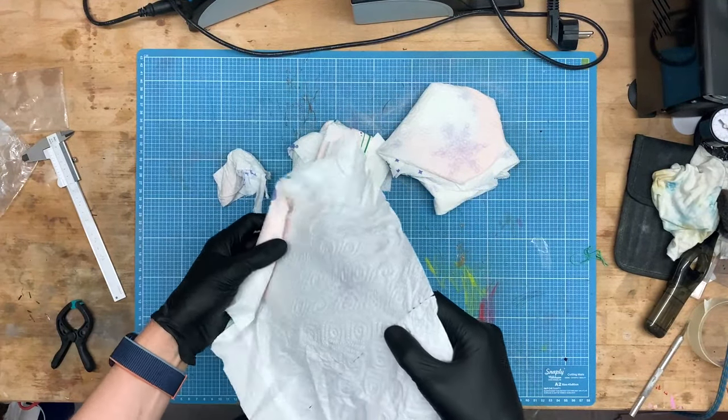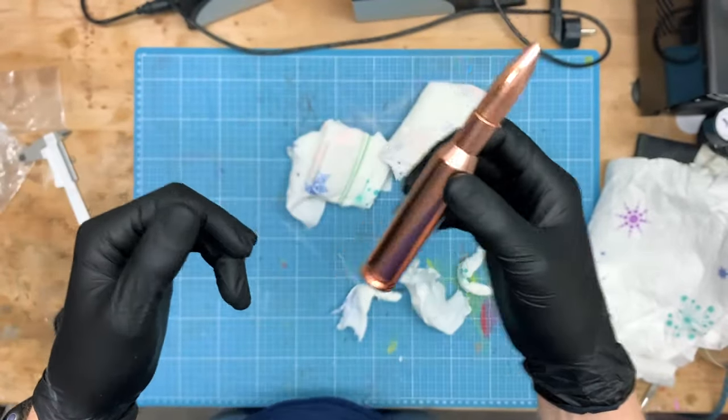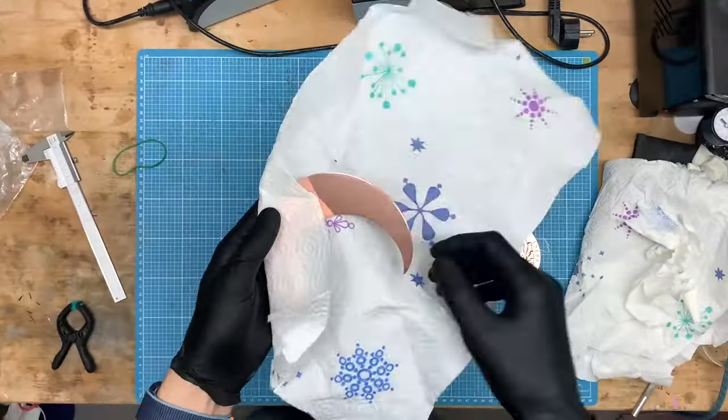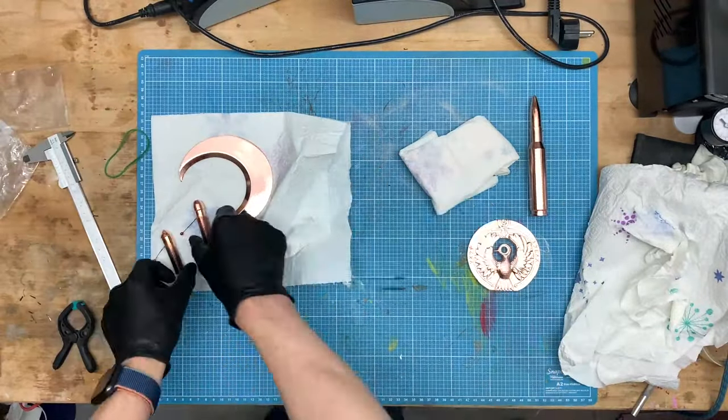Be careful to rinse and dry the freshly plated parts directly with distilled water. Copper immediately oxidizes uncontrollably, which is rather a hindrance for the further processes. But I am already quite satisfied with the first layer — that was the most difficult part.